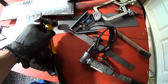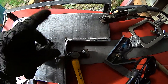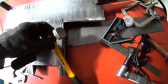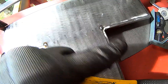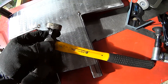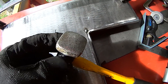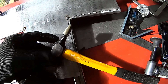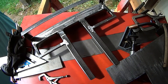Every time you tack something, you should try to tap it with a hammer — it's going to expand slightly and likely lift, so you tap it back down. Don't just use any old hammer though. I like something with a round curved face — that's a body hammer. I've pretty much dedicated this one to tacking stuff together. It's got a nice point on the back side for getting into corners. It's a good tool to have at your bench as you go along.